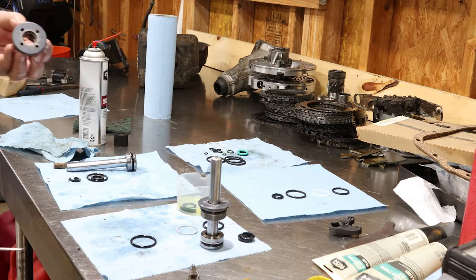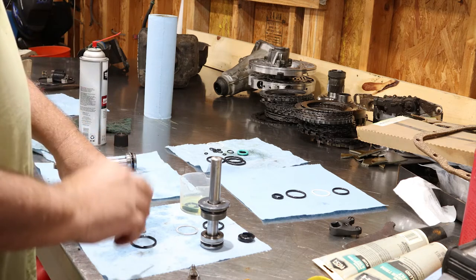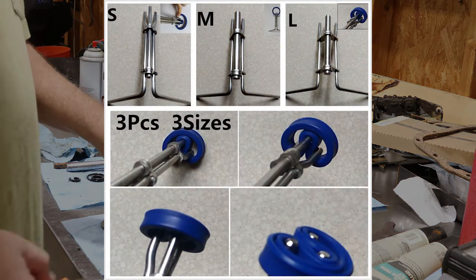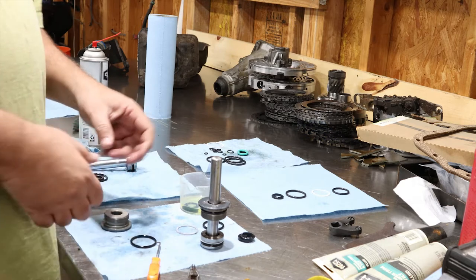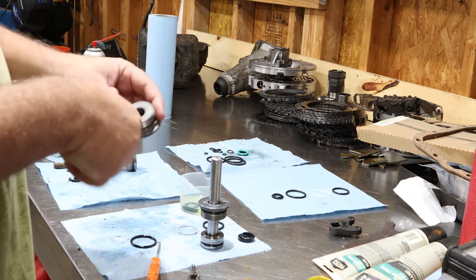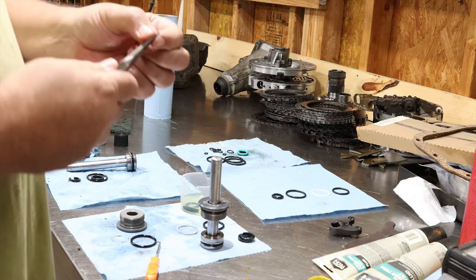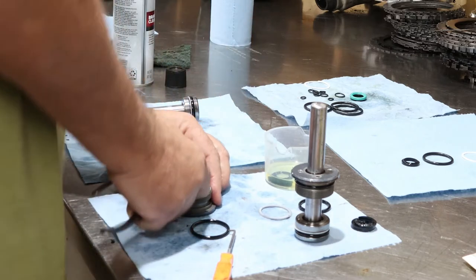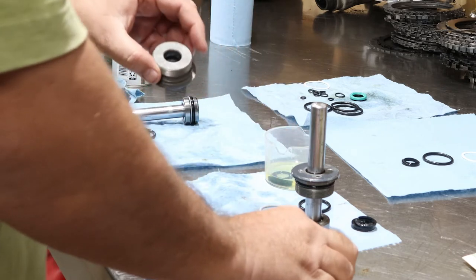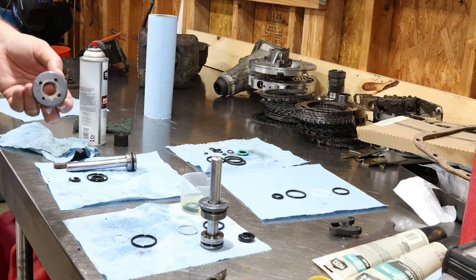We got the first one on. We'll let them soak in some oil for a bit. Since we don't have one of those seal tools — the little three-pronged thing that pinches it into shape — it really won't work on this small of a rod anyway. Philip was able to just kind of get it in there. If you can just get it caught in the groove when you're pushing down, you can work it around and get it in there just by pushing it on the table. The last little bit we did have to use something blunt — the front of needle nose pliers — to work that last bit down. Once it's all in, push it down and it snaps into the hole pretty well.